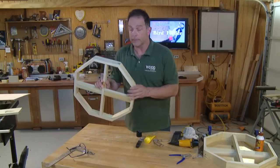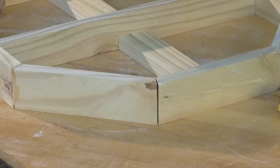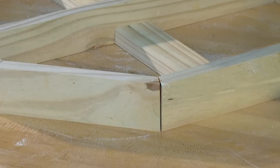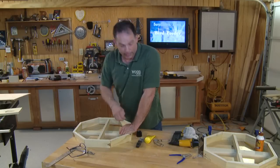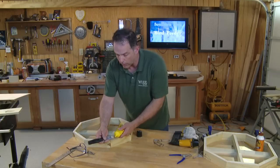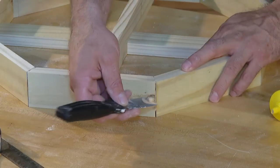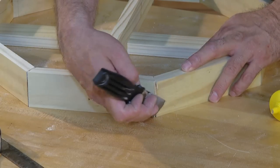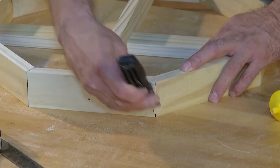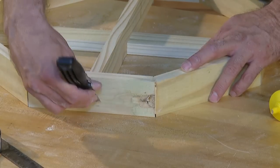While that one's drying, let's take a look at this one I made a little bit earlier. The miters aren't perfect and there are all kinds of imperfections — quite frankly I'm not happy with how the tops of these pieces lined up. Do we throw it away or do we fix it? I'll show you how to fix it. Love the stainable wood filler — this stuff is great, and the best way is to get it in the tube, it's just a whole lot simpler to use. It's a lot like toothpaste except it doesn't taste as good. A little on the putty knife and we're just going to fill in each one of those joints, and any knot holes and nail holes around the perimeter of the entire piece. Once that dries we'll sand it all smooth.